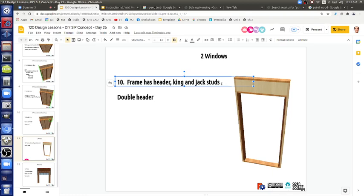Not sure how that matters, because we've got a top plate there, but I guess that does matter a bit, because they end up being at 24-inch centers, which means you're spanning every joint, then you're in the middle of that and spanning those joints. Yeah.